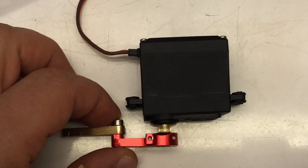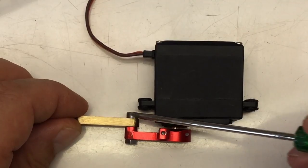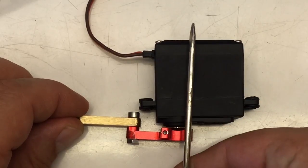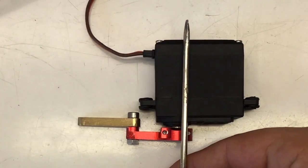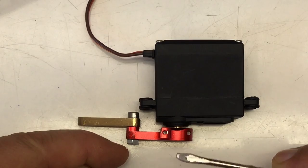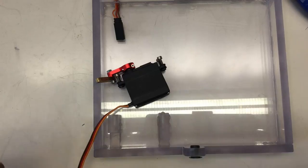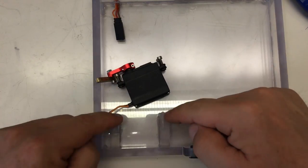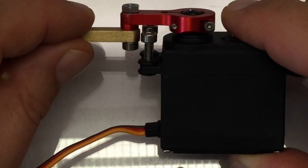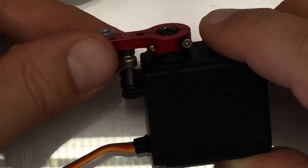Next, we attach the servo arm to the axis, and please note that I went in here with the connecting rod so as to minimize the axial forces acting on the axis of the servo, because if the rod is further out and pushing, you have a longer arm on the axis. Now we can attach the servo to the mounting blocks and the lower case, and please note there is just enough clearance so that the connecting rod assembly will not interfere with the heads of the screws.